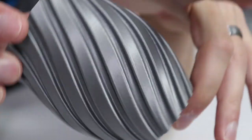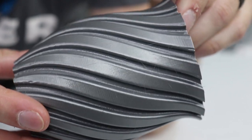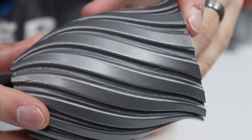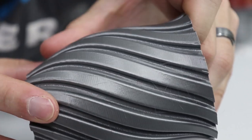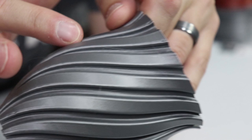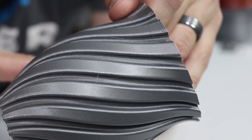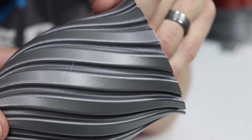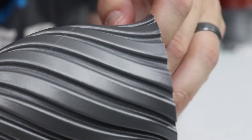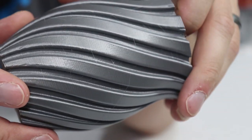Finally I have a vase — the exact same gear vase that I printed last time as well. I wanted to see how it turns out in vase mode. You can see some of the layers sometimes, but most of it is completely blended in. A little stringy, so as you can see it was a little too hot. We could have done 207 or 208 degrees, which would have probably been better. But I just wanted to get a test out and see how it turned out, and yeah it turned out fantastic.